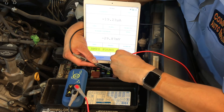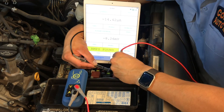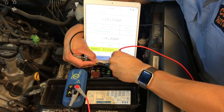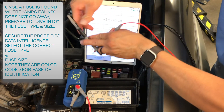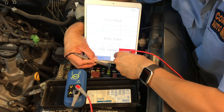Once a fuse is found where amps are detected and that reading does not go away, we then prepare to identify the fuse type and size. Secure the probe tips to the fuse, then select in the Data Intelligence menu the correct fuse type and size — note they are color coded for ease of identification.